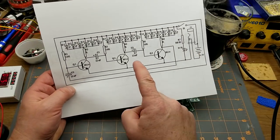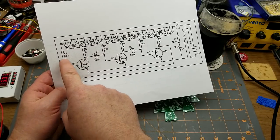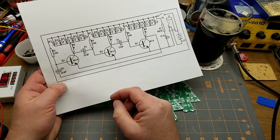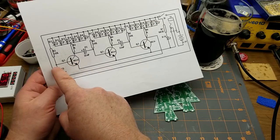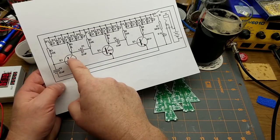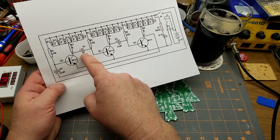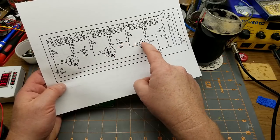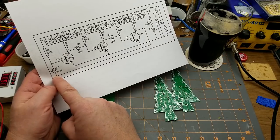So what goes on? Basically the base of each transistor has an RC timing circuit. This capacitor slowly charges through this 10K resistor, which — using an online calculator — takes a quarter to a third of a second to charge above the 0.6 volts base-emitter forward voltage to turn that transistor on. When it turns on, it brings this point down to ground, which means the next capacitor is now charging through its resistor, then the next one turns on, and so on.